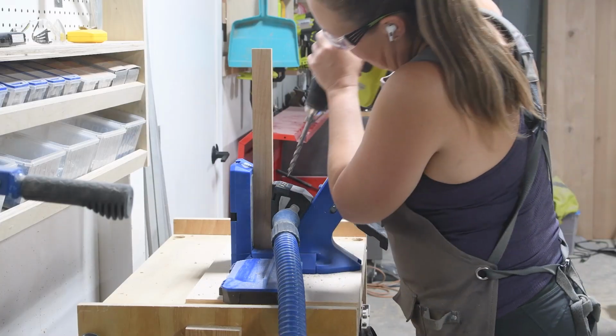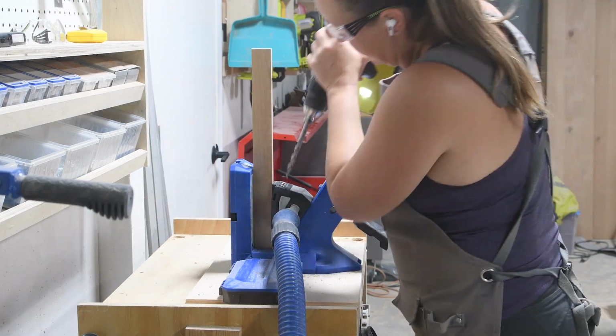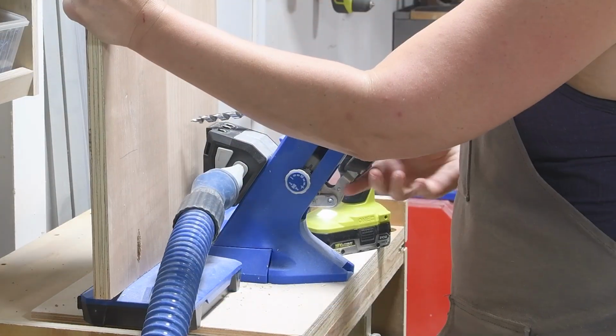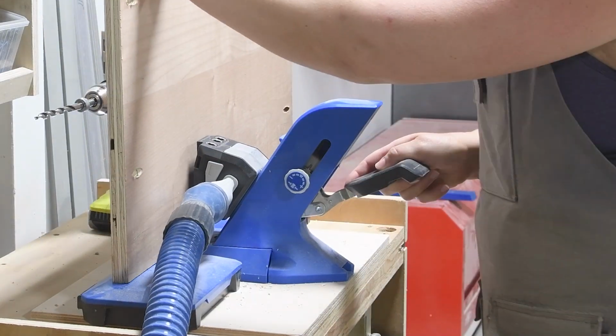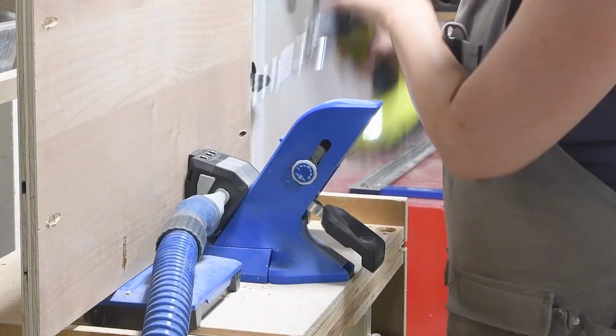First up is to build the sides of the nightstand. I added pocket holes to the short edge of the trim pieces, making sure to center them on the board carefully in the jig. Then I added pocket holes to the perimeter of the side panel pieces, making sure the pocket holes on the top and bottom are set in a bit from the edges, so they will not be in the way when the pocket holes on the trim piece when I attach them later.